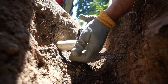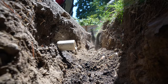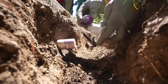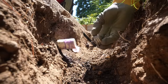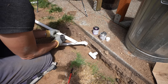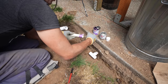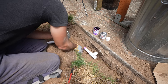For this project, you definitely want a PVC pipe cutter, which makes life a lot easier when cutting pipes, especially in awkward areas. When it comes to installing all the elbows and tees, I'm using Oatey — a two-part mix. The purple product is a primer that you apply to your PVC pipe as well as the connection fitting. Let it dry for a couple seconds, then apply adhesive to both sides. Once both sides are fully applied, squeeze them together for a permanently watertight bond. Hold the connection for 10 to 15 seconds, and within that time it's seemingly permanently bonded.